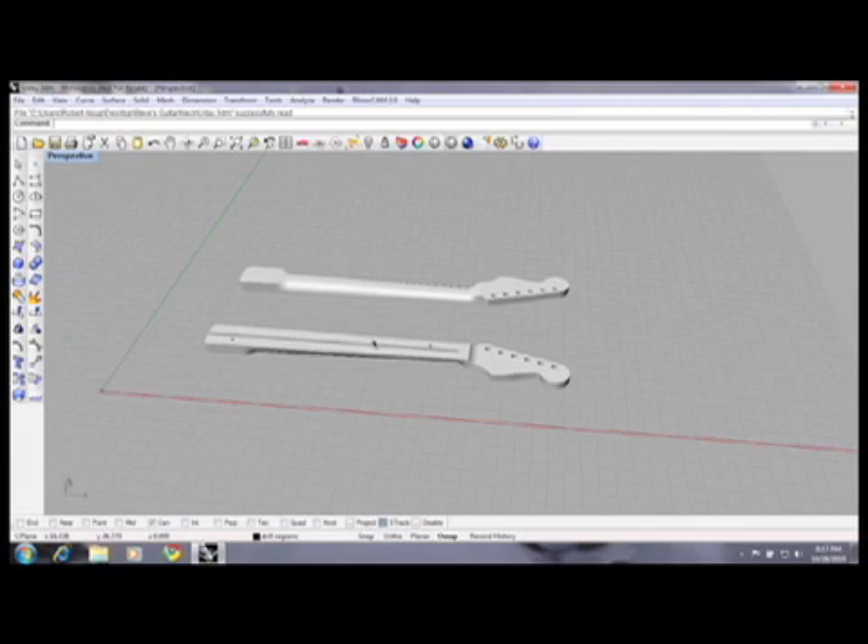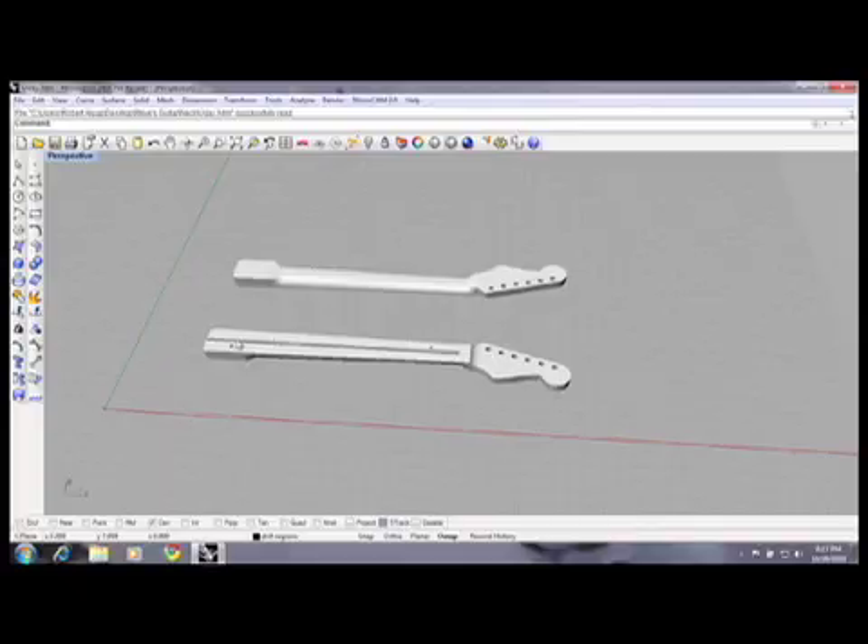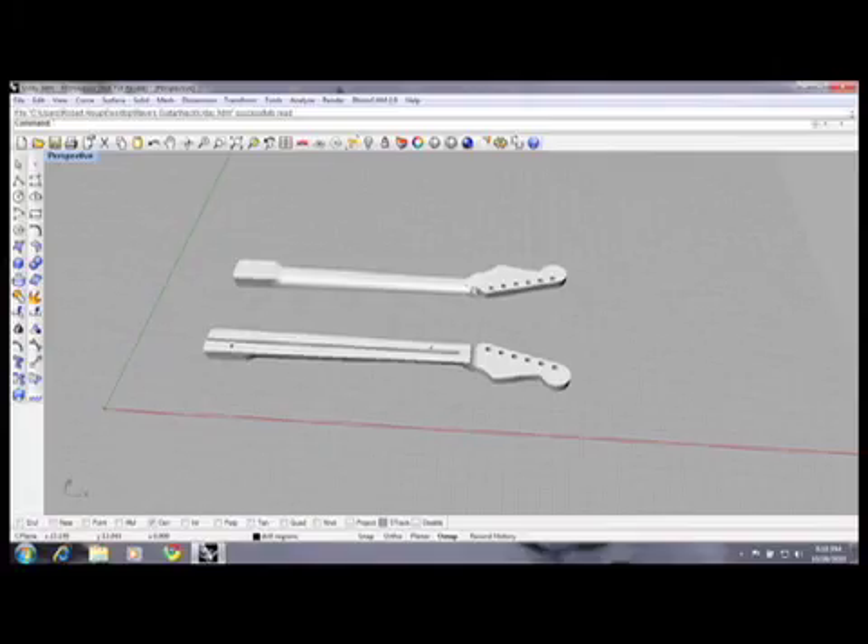This basically shows the table setup for the machine. This corner is the origin of the drawing. The machine we're cutting on is the Laguna CNC Swift series, four foot by four foot — very popular. I've got this set up in two stages. First stage, we put the blank on here; we'll be holding the blank down with double stick tape. We'll do the surface machining here, roughing the outline out, then flip it over to this position using locator pins. We also have the ability to customize the heel transition area, which is almost as important as how the neck feels in hand.